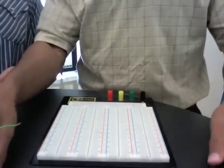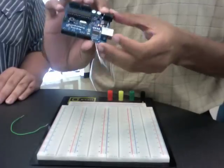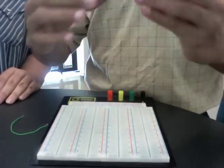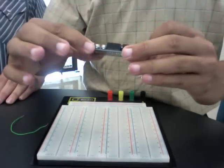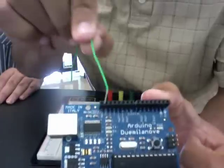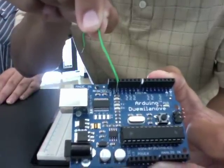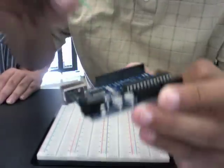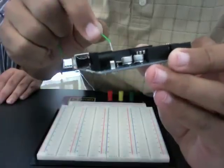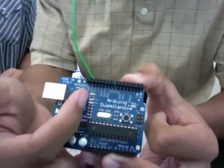We'll take our Arduino board. For the simple blink, if you look really close, it's going to say LED pin 13 right there. We're going to hook this right in there. It's going to be coming out, so that's positive — it's going to be giving power through that LED pin 13 connection right there.